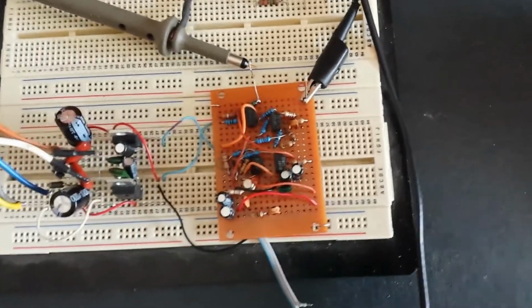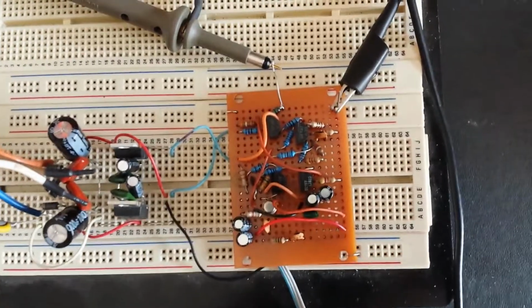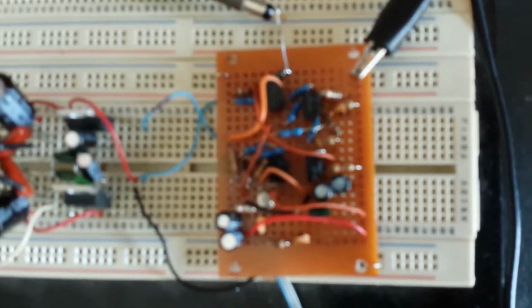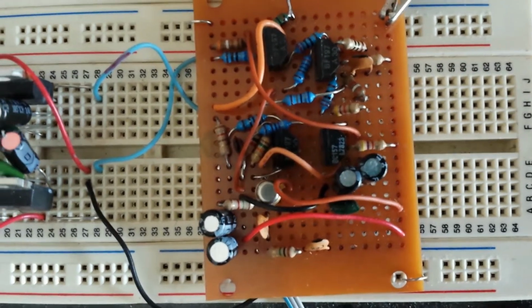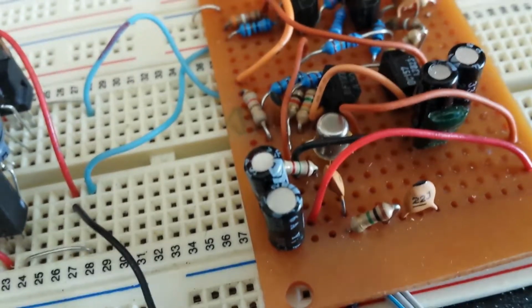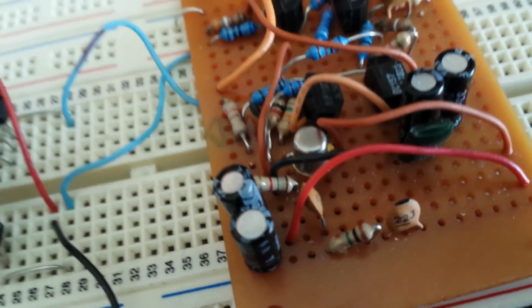But anyway, I've copied it pretty much to the T, and I double checked, triple checked it to make sure that everything was connected properly. In order to replicate it right to specs, I had to order the original transistors from overseas. I'm using BF197s and a BC157, a few BF197s, and I think it's a BFW11 field effect transistor, which had 4 legs. One leg's for the shielding, the rest is gate, drain and source.